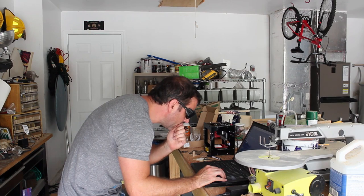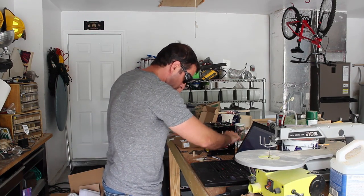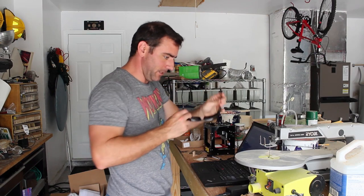Let me get these glasses on — that is a bright laser, and it's not even really on yet. So: run the script, then give it the serial device /dev/ttyUSB0, then the image — I'm going to do a Punisher skull — and burn time of 10. Let's see if I need to run it with sudo first.